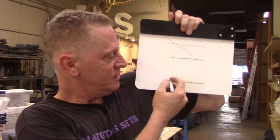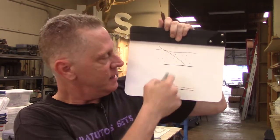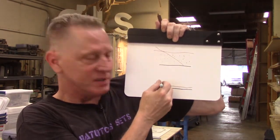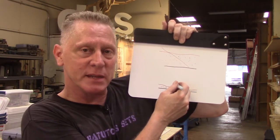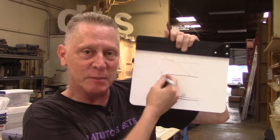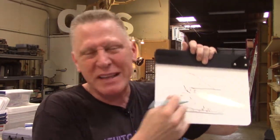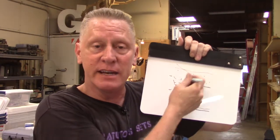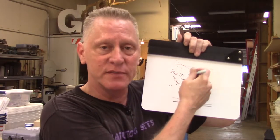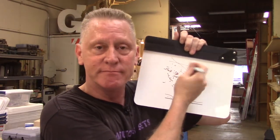When it dries, it ends up being much thinner because all the solvent has evaporated, but all those particles are now hyper-dense within this space. What ends up happening is it gets a lot darker as it dries, so you want to spray probably about half as dark as you want it to be, and then let it become darker as it cooks off. And then if you need to spray another coat because you want to make it darker, well, then you can do that too.